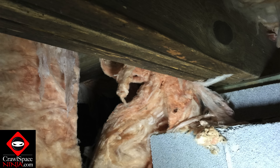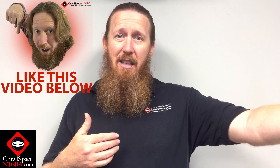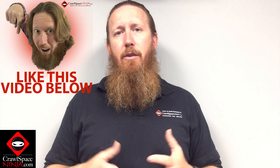The problem with rim joists is that they're never insulated, or if they are insulated, they'll take a piece of fiberglass and shove it into that rim joist to create a thermal barrier. Now here in Tennessee, we don't always need a thermal barrier in our rim joists, but it has been getting colder in winter. We've seen condensation forming on the rim joists because the crawl space will be warm and the outside will be 25, 30 degrees or even in the teens, and that cold air hits the outside of the building, transfers through the rim joists, hits the warm air in the crawl space, and actually creates condensation. So if you want to help prevent that, it's a great idea to insulate the rim joists.